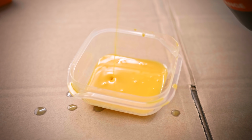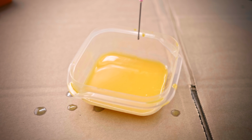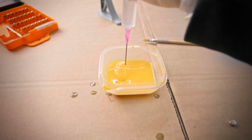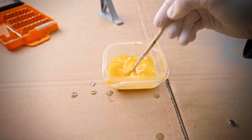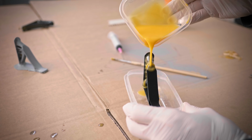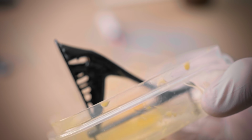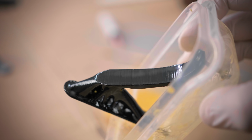And since the thinned down resin worked so well, why not just keep going? This time I mixed up more of a 2-to-1 mix, that is 2 parts solvent and 1 part resin. This stuff is super runny, definitely much closer to pure isopropanol than to resin, and I did the same thing. Pour it over, drip it off, cure it. It's weird because the surface almost instantly turns super smooth and glossy on the first coat, even though this mix is a lot thinner now.